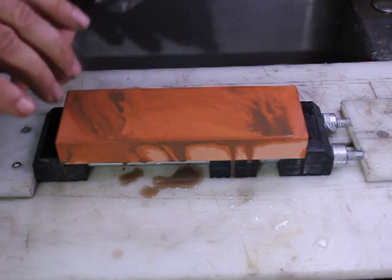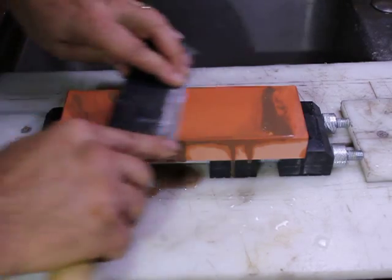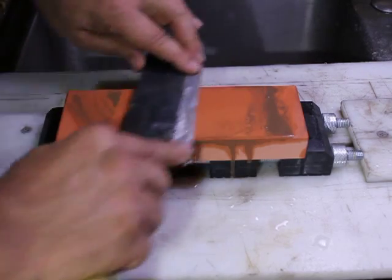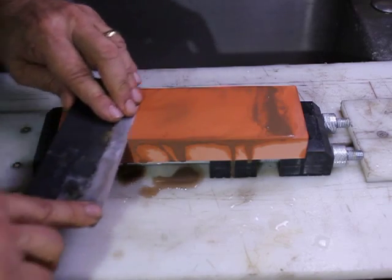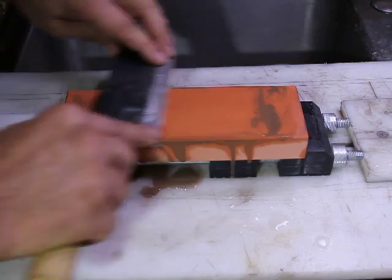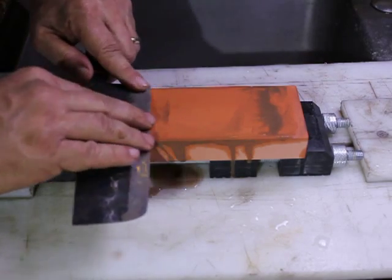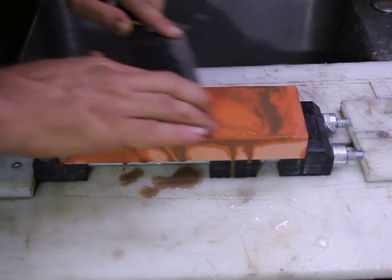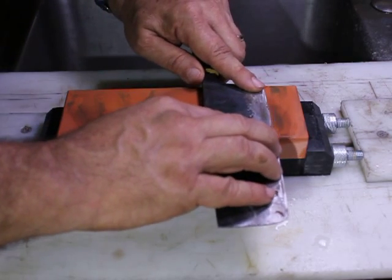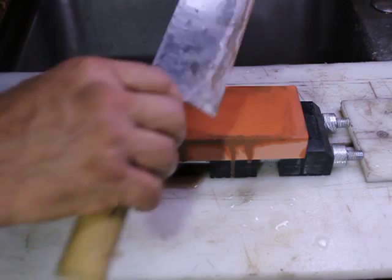So it seems to cut carbon steel a little bit faster than it does the powdered steel, which is expected. This is probably a white steel, thin nakiri. My guess. I'm not 100% sure of that. So the white steel does tend to sharpen more quickly than the powdered metal steels. Okay, a little bit more. Slightly steeper angle. I want to call that a micro bevel.